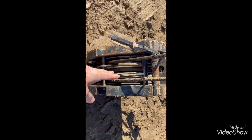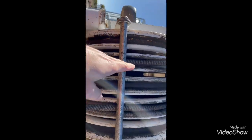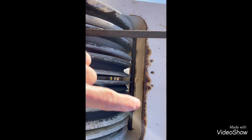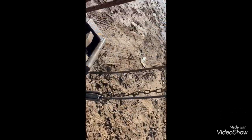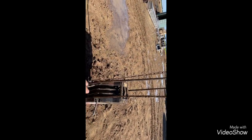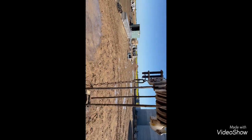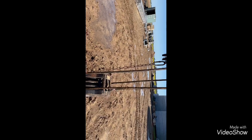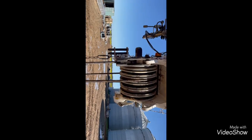I've done two and four here, and two and four on the other side — side and side. Now this bar goes over the top of the ropes, and then check that the rope is underneath that bar, and then the pins are in. I've got a perfect amount of slack for this rope. You know how I was saying before I winched down a few more meters because I'm reeving up? If I didn't — if I kept the hook this far from the pulleys and I jib down and let slack go — I would have had no rope to reeve up here. So if you're reeving up more falls, you leave more slack down three to four meters. If you're taking out falls, you leave it up about this high before you jib down.